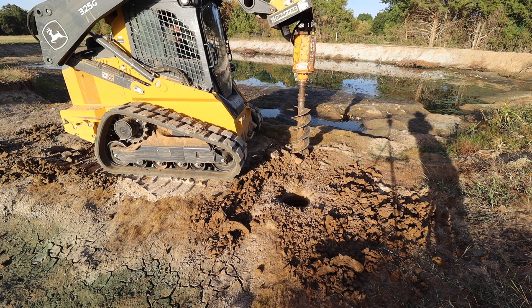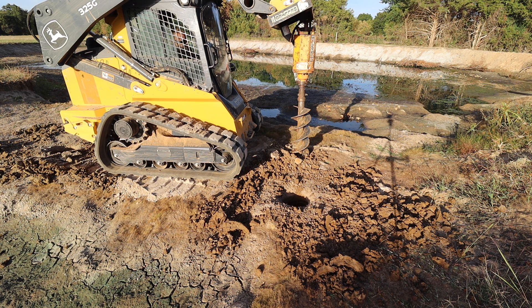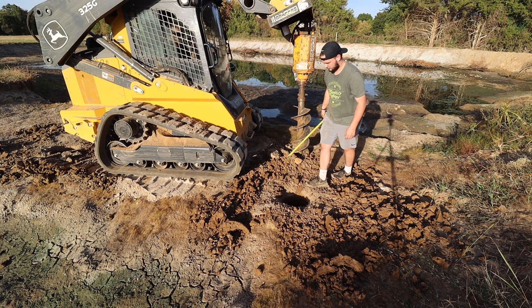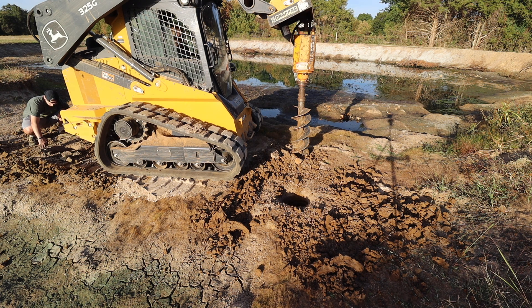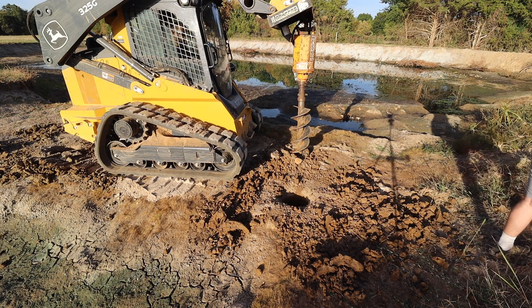Let's get a tape measure and see if we're 40 inches side to side from that other hole. If the length is too close to the bank or too far, that's okay — the rail just needs to set on it. But we do need to be 40 inches apart, center to center. The measurement came in at about 42 inches, so just a tiny bit over. Center to center on the other two holes came in at 41 and a half. So I can dig right here — we can make the bridge any size we want, we just need these holes to be the same distance apart.